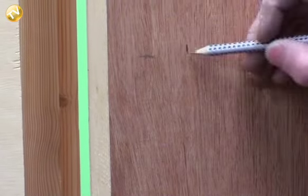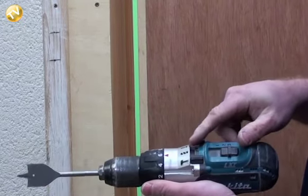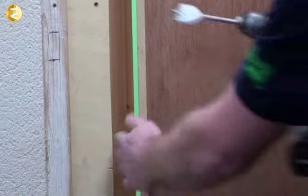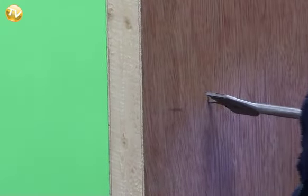We mark 60mm, knowing we've got our height of 1300, 60mm in. Then we get our drill bit — for this particular lock it's a 32mm drill bit. Put this into our drill; this drill has got hammer action, screwdriver, and drilling action — just set that onto the drilling action. Make sure the door is stable, put your foot onto the door, or use wedges if you've got them. Place the drill bit onto the door, hold the door securely, and start to drill the lock out.